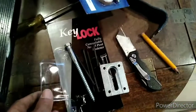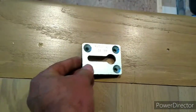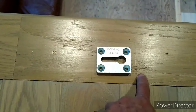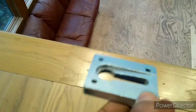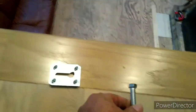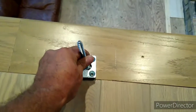The key lock comes with a 9/16 bolt and it has this little plate that we're going to be inserting. I already made my mark — this is my mark from my post — and what I'm going to do is insert this piece right here, just like that. You scribe all these with your pencil and then you secure it inside. This piece has to be a sixteenth of an inch below the wood. Inside it has this wedge, so this piece gets installed like this, and then this bolt gets installed inside the post right here.